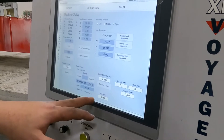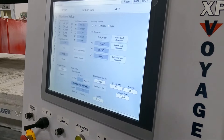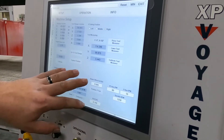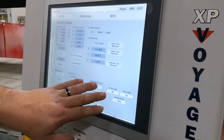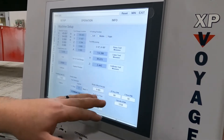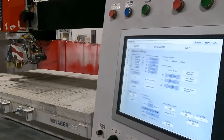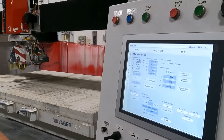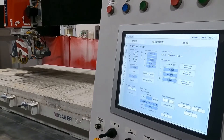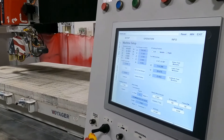We want to make sure we have an approximate idea of what the kerf is. You can measure the blade teeth itself — I always measure in the stone. The offset number is what we're going to capture. The XY axis speed is the inches, that's going to be our feed rate. The Z is going to be our plunge, and then we have our spindle RPMs depending on the size of blade we're using. We have the 18-inch terminator on, and the suggested RPMs we use is 1250. We're not going to adjust the inches per minute or the Z because those are also the feed rates that we set that blade up to.